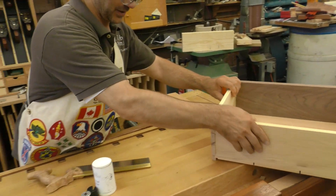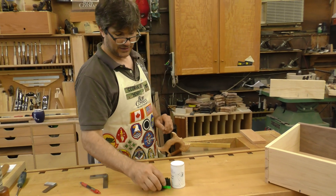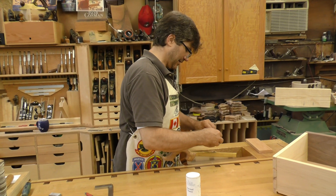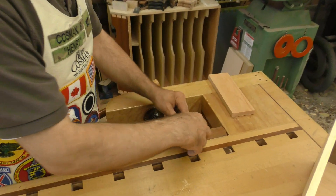So let me show you something I have that may help. What you do is take your dovetail saw and put it in your vise so that it's holding it standing plumb. Take my dovetail trainer. There's a little nylon set screw on the side, and as long as your saw has a quarter inch brass back it'll fit and it won't leave a mark — put that in place.